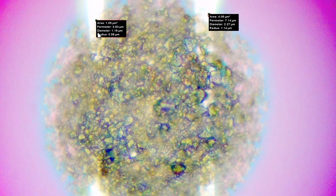Focusing on the metal oxide material in more detail, we notice a wide distribution of particulate matter. It's mostly significantly large particulates, but you also have finer ones spread towards the periphery of the droplet. Measuring their average size: towards the periphery they're down to the one-micron region or even potentially smaller - somewhere around a micron or potentially below, slightly in the higher-nano 100-nanometer regime.